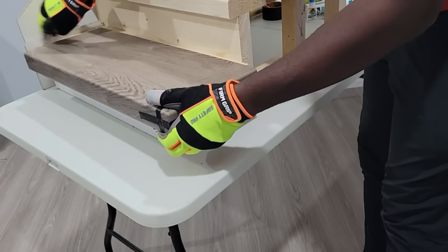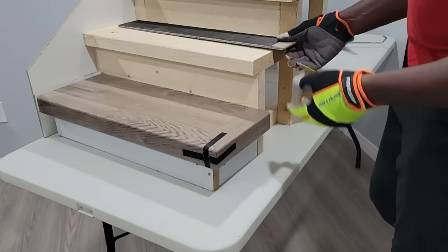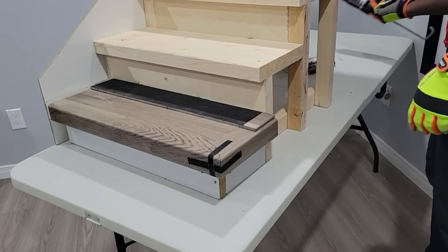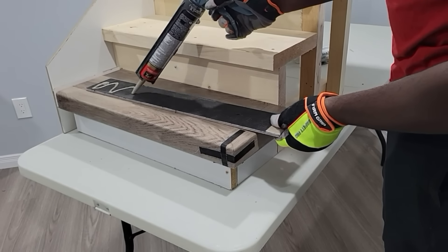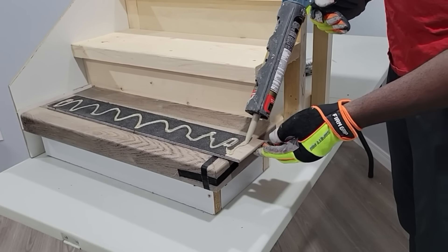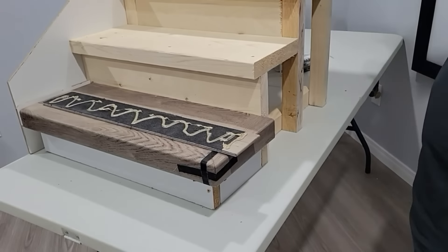You can see there we use PL Premium and we're going to be putting it into place. This is why that back cap is not on at the moment. You can see the black tape there — that's just holding it while we do the installation and will come off again. With the risers, these are all custom made for open staircases, just understanding that that edge is open, and so it does have that vinyl wrapped around it so it has that same beautiful finish as we go along. If you hit the subscribe button and check out our channel, we do have lots of videos of us doing full installations of the open stair nosings.